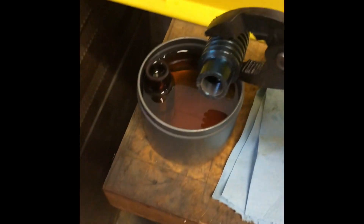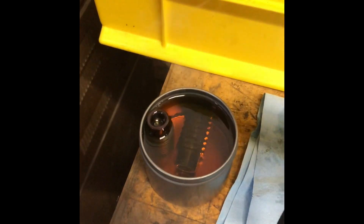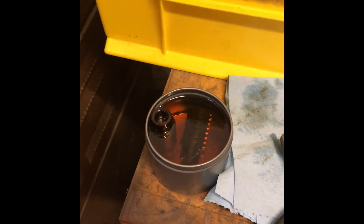I'm going to move the other one to the hotter side of the oven — it's still gold. After dialing it up to 735 and letting it bake for a little while longer, we've got a nice blue color on this one. So we're going to pull this one out and drop it in the oil. That's really blue — that's nice. Let this sit and we'll check it back in about 10 minutes after it's cooled a bit.